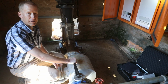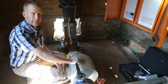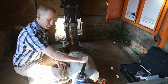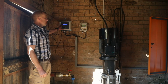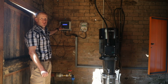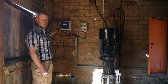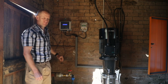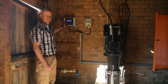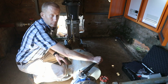As I close off the inlet valve, you'll start to see that the inlet pressure reduces until ultimately the system trips. So we'll start off by closing the valve by a small amount. The inlet pressure has now dropped from 35 kPa to 32 kPa, so closing the valve has had a small impact at this point. We'll continue closing the valve and monitoring the pressure. I've closed the valve some more, and now the inlet pressure has dropped right down to 10 kPa.